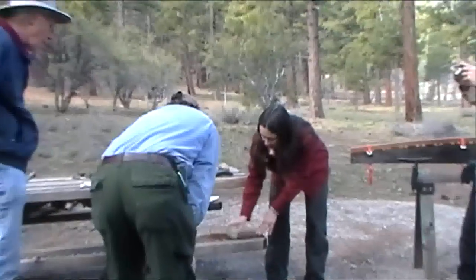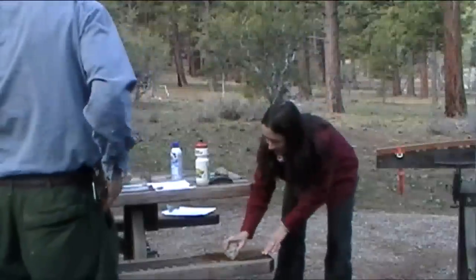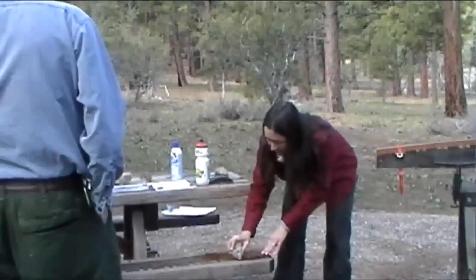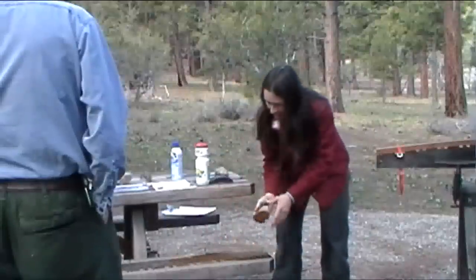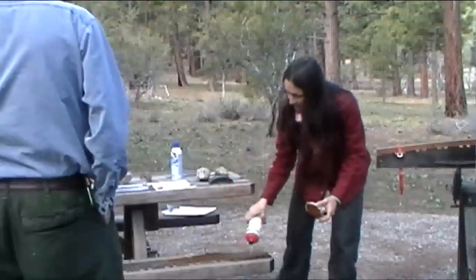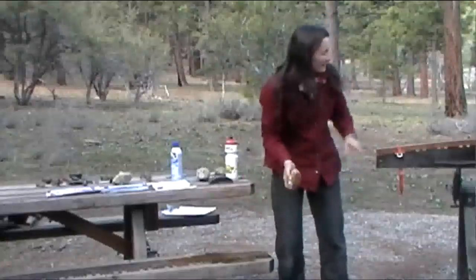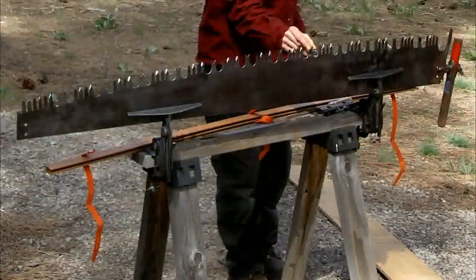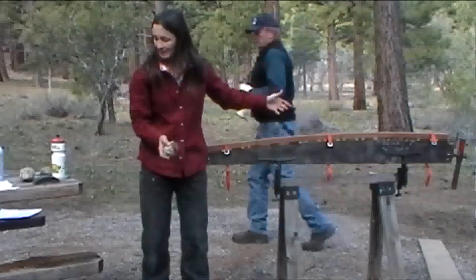If I do scrub up at the points, I'm not ruining the teeth — they're ruining the stone. No problem there, so I can clean right up to the tips of the teeth. Another good thing about this pumice stone is I'm cleaning the saw with a flat surface. So if there's a bump or a kink or a dent in the saw, it's going to be highlighted. See all those shiny spots? As I cleaned that saw with my pumice stone, it highlighted all the bumps and ripples, and it gave me a little bit of idea of what happened to that saw. I think somebody got it stuck once and broke it and then hammered on it a lot to straighten it out and made those marks in it.